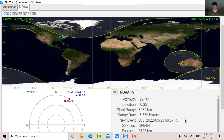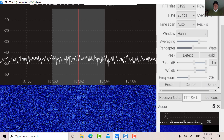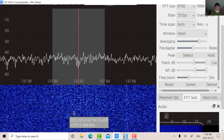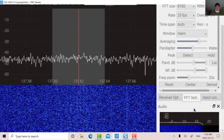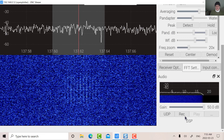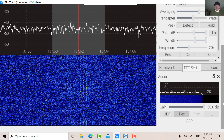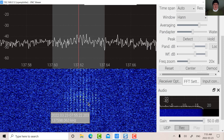We'll start to listen for a signal. You can sort of see on the waterfall — it shows up first. You can see some traces there, so something's happening. As the elevation increases we'll start to pull in our signal. I'm going to start to record now. You can see the 2.4 kilohertz there popping out of the spectrum. Yeah, we can see our lines here — they're fairly decent.